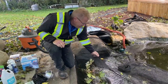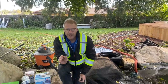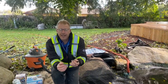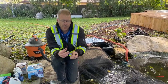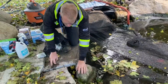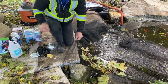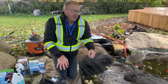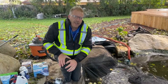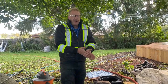So we can also put a fine net over top of the pond. To hold this netting down, we just have these little metal staples. Some pond netting kits come with little plastic spikes — these are the same kind of spike we'd use to hold down landscape fabric or even sod on a steep slope. We could use a few rocks to help hold the net down. But you still may have to occasionally clean the leaves off this, because a continuous layer of leaves on top can actually be hard on the fish — not getting them enough oxygen. The more it accumulates, the heavier it gets, so cleaning it off periodically isn't a bad thing.